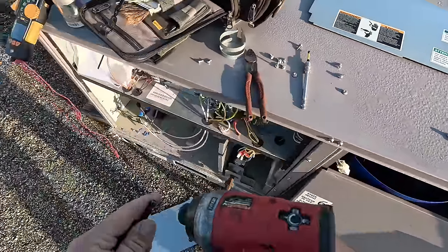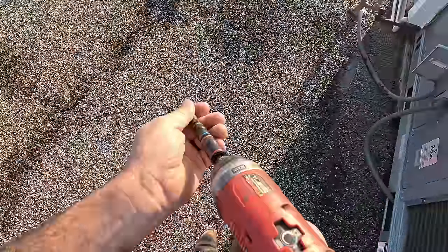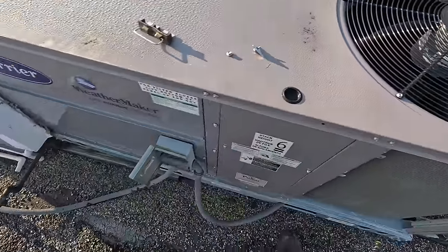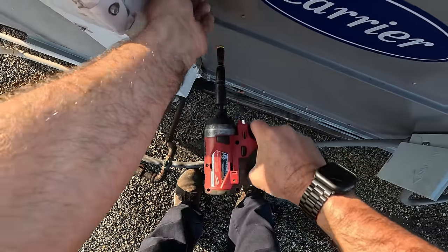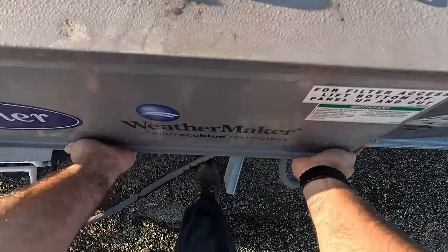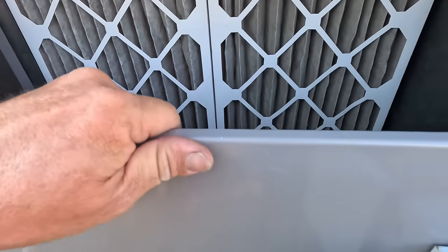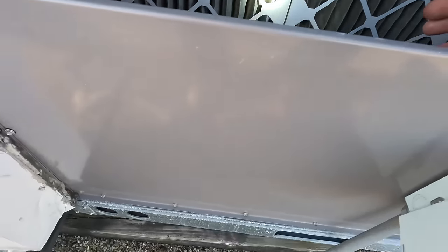Funny story — our local Carrier supplier doesn't have the capacitor. After talking to one of the other guys, they don't even make the capacitor. This motor right here takes a 10, and why they use a condenser motor that would need a 10 is beyond me. So what I'm doing now is double checking my filters to see if I need those, that way when I go get something I can get it together. They have a 70 by 5, which is probably what I'm going to get, and then double up a 5 — not horrible, but they're definitely getting there. I'll give him the option to get those replaced while we're at it.